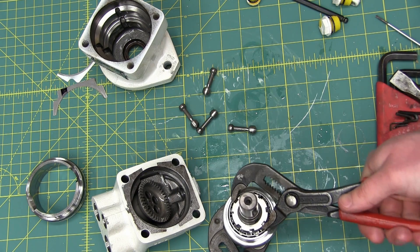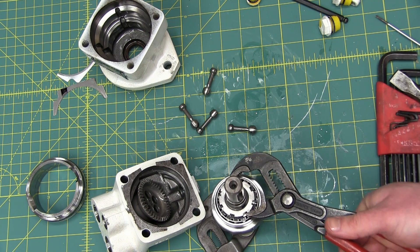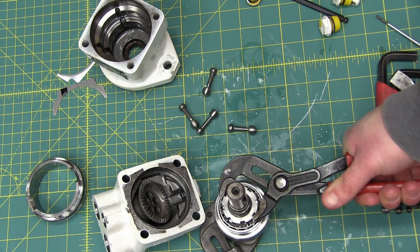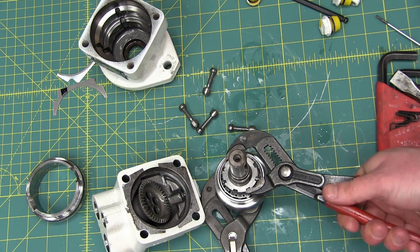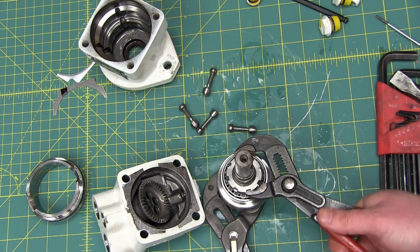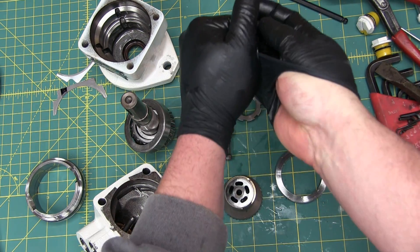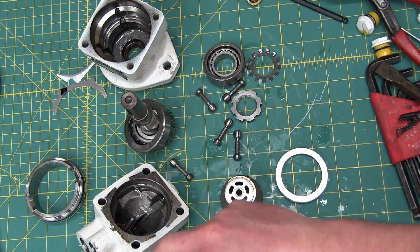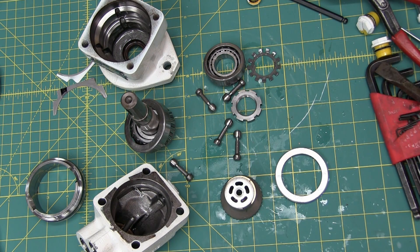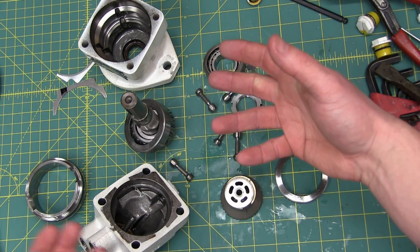The preload on tapered roller bearings is absolutely critical. So there will be a torque spec — click — and then just back it off and double-check essentially. Remember, this is not at operating temperature, so it's going to heat up a little bit. When it heats up, it expands — so we don't want to cinch it right down, we just want it so it contacts. I'm going to change my gloves, get this the old spit polish, see if we can't get her back together. And then maybe run it on air to see if we can get her choochin'. I do have a hydraulic power pack here, but it's not set up. So we'll try and run this on air, and if we can, we'll get the borescope right in the casement and see what we can see while it's actually turning.